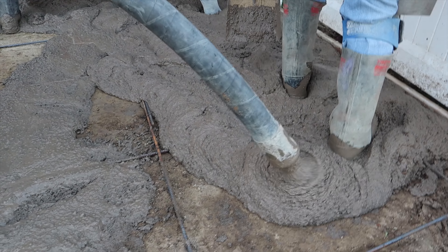That's a four-foot magnesium bull float with a rocker arm on it. As you can see, I've got the vinyl post in in the background. Off the reflection of that window you can see how the tape at the bottom is catching a lot of that buildup around those posts, so that worked out well. This is going down about a four-inch slump — you can see it's very difficult to rod and it's not really bull-floating that easily.